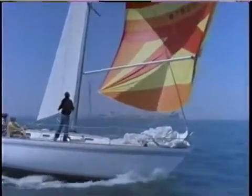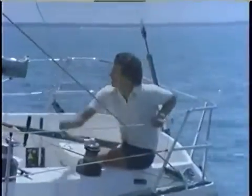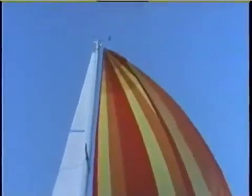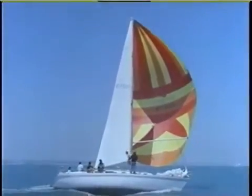This pole trimming technique is a direct result of the development of flatter, closer-winded chutes. The pole will also be carried lower as the wind goes forward. As you sail higher and the sheet is trimmed in, the clew comes down and aft, along the line of tension of the sheet. If the pole is not lowered enough, the head of the chute can become very unstable, with the top washing out to leeward. As the clew comes down, the pole must be lowered to keep the clews level.